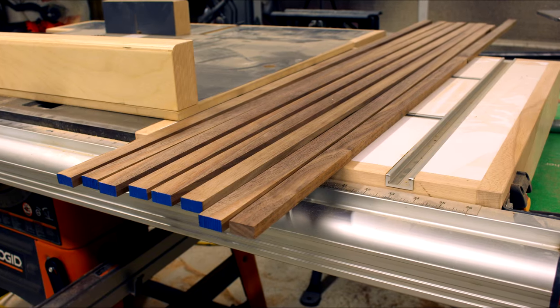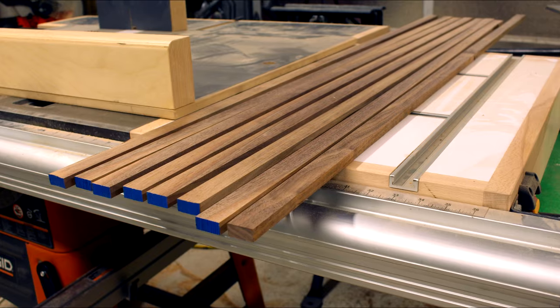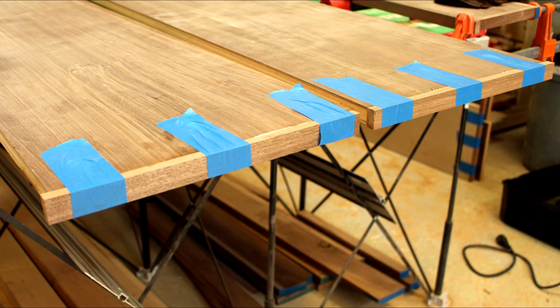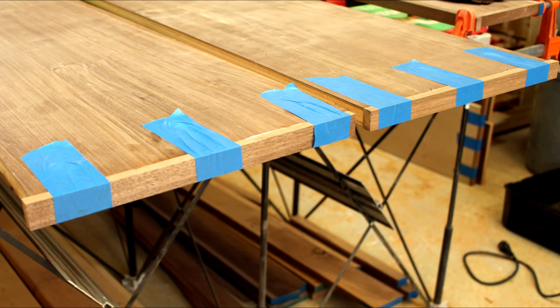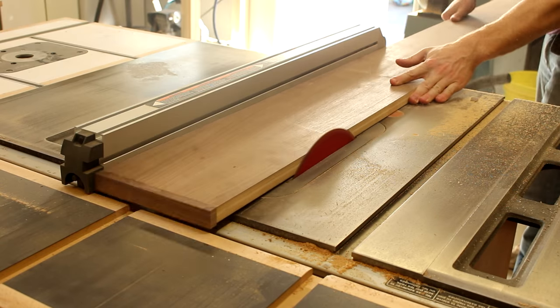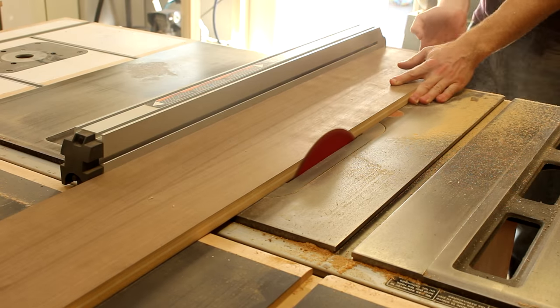During the first video I covered how to make these solid wood strips. I started off by building the side assembly. Here you can see the solid wood edging that I applied. I glue and tape solid wood edging on and allow four hours to dry. After the tape has been removed, I run it through the table saw to trim off the excess solid wood edging.